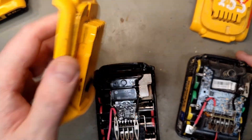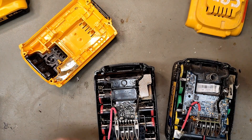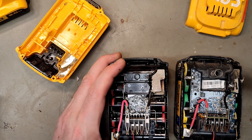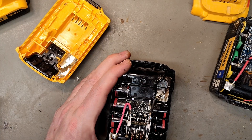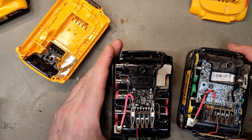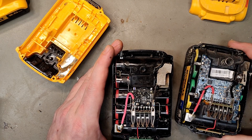What about the 18V 5Ah batteries? One has Bluetooth and one doesn't. The one without Bluetooth is from 2021. On both, positive and negative are directly connected, and we can see burn marks on the terminals — those have been short-circuited. They offer no protection from adapters, so that's possibly exactly what a customer did to those poor batteries.